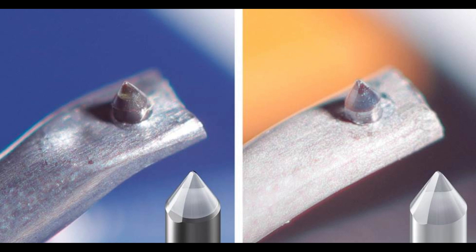That rattling is the distortion that you hear — the stylus is actually leaving contact with the groove wall and slamming back in. And whenever you hear that, you are wearing your records. Distortion you can hear means you are permanently damaging the record, especially if you hear a lot of distortion. So for a lot of reasons, both audio fidelity-wise and long-term record life, a nude stylus is better — it just happens to be more expensive.